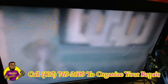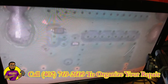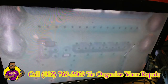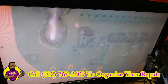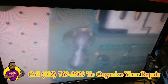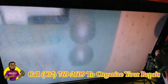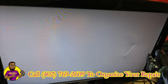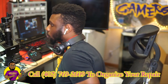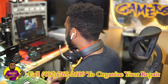I'm going to do one more cotton swab — this time completely dry with no IPA — and just go around and clean this all up. Let's check underneath the HDMI port. As you can see, both that filter and that component are still right there. The solder connection looks beautiful — as you can see this solder connection is bridged, which is an even better connection because it will ensure that this HDMI port just won't end up falling off.